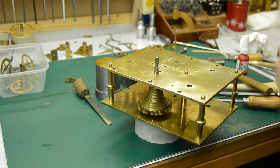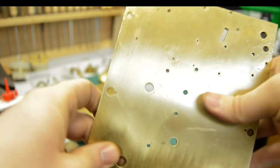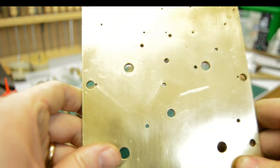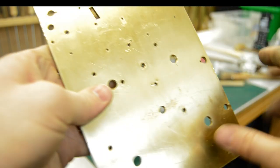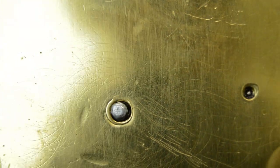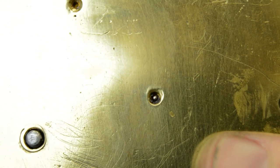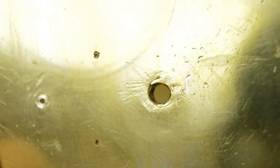Here's the plate after it's been cleaned up. I'll try to do minimal intervention on the cleaning front, but this plate had been so badly worked on in the past that I did have to be a little bit invasive in removing scratches and file marks. Now onto the back of the fusee bush — you can see it's been previously bushed and then this is in turn worn. Also the back of the centre wheel again; you can see the dirt in the pivot hole still, and you can see the bit of a mess they've made of the back of the fusee, and what I meant earlier about the plate having been filed around quite a lot when these bushes were fitted.